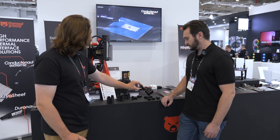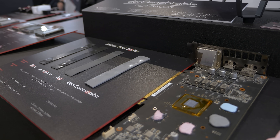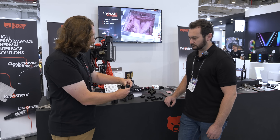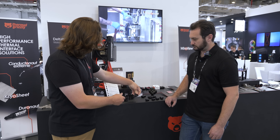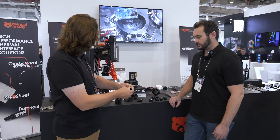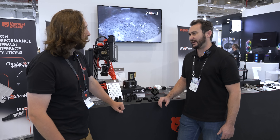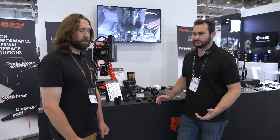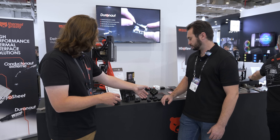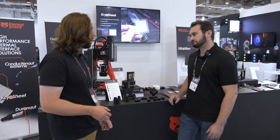You can make it smaller with just a 7-millimeter extender or you can make it bigger. Because it's so small you can screw multiple together — here you can see two 90s directly next to each other, giving two axes of rotation, and also with an extender between. These have an offset of 28 millimeters. If you change the system configuration, you can take these apart and reconfigure them without having to throw them away and buy different connectors. It's a very modular type system — each component is made as small and simple as it can be.